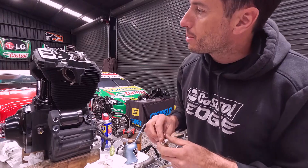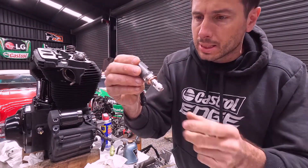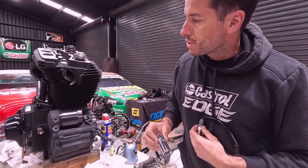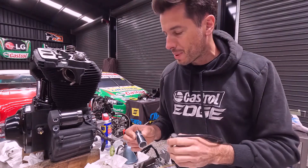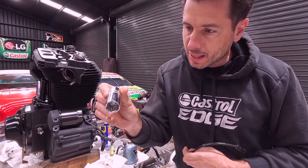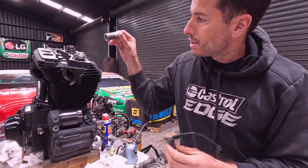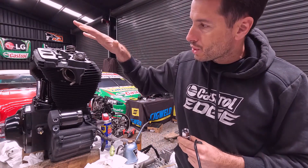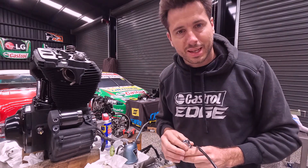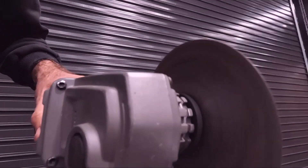The decompression on the top of the cylinder got burnt in the fire, so I've got a couple of new ones here. Unfortunately, because of the cable, you can't get a socket on there. I know there's a specialty tool you can get from Harley, but I don't have access to that at the moment. So I've got a cheap socket from Bunnings. I'm going to hit it with the angle grinder and make a slot up the side so it goes on, and then we can get the top covers on. The valve train all sorted out and the engine will be basically complete, ready to go in the frame. Out comes the angle grinder.